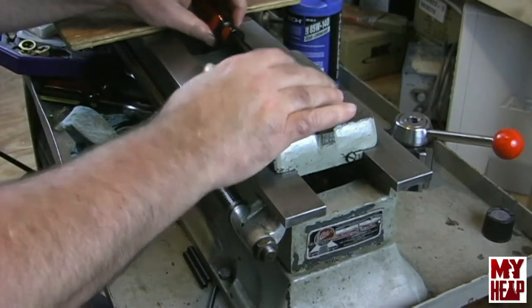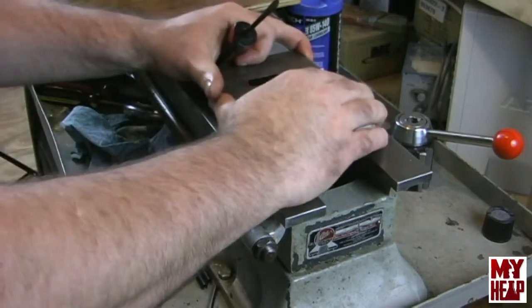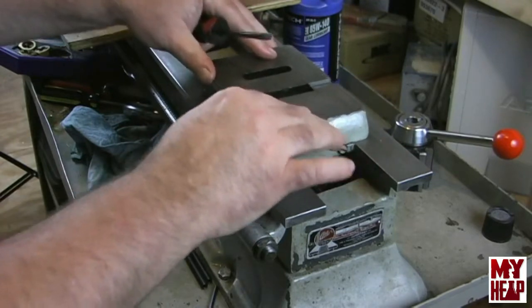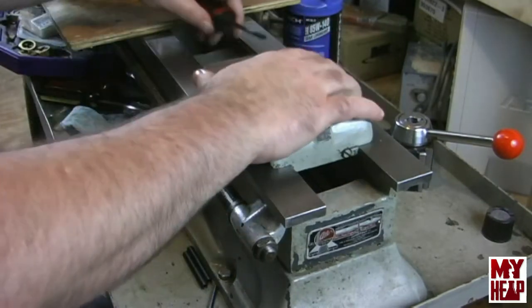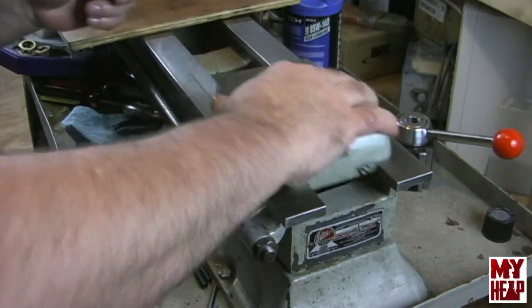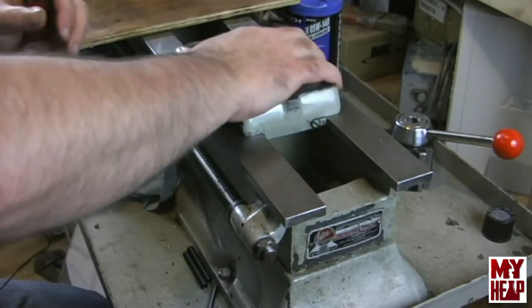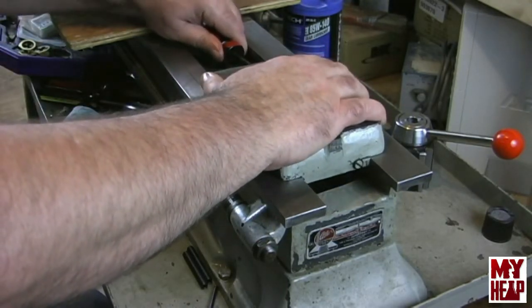So now the screw's quite loose, so I'm going to just tighten this in. I'm going to make sure that I get a good even sliding motion there. I don't feel any play. I guess I could put a gauge on there, but how I'm going to do this is I just want a good feel to it. So I'm just going to touch these screws just a tad tighter. And I like that. I like how that feels. There's no perceptible play when I move it.